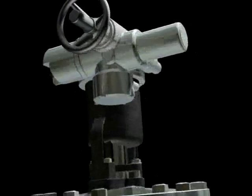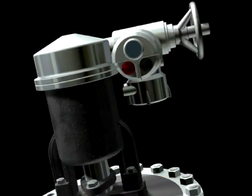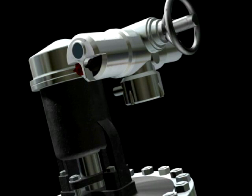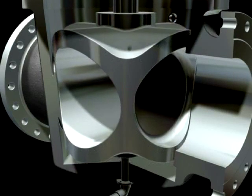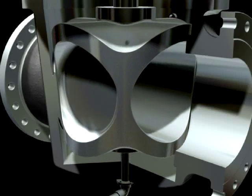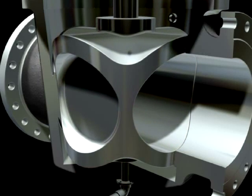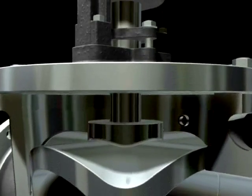The Pacific Wedge Plug features the unique wedge torque system. This single-action lifting plug operator prevents sealing surface wear by eliminating rubbing contact between the plug and seat during plug rotation. The wedge torque system's low torque requirements make it easy to automate using electric motor or pneumatic cylinder actuators. When the operator hand wheel is turned, the fast-acting wedge torque operator first lifts the plug straight up from the seat. As operator rotation continues, the plug rotates to the desired on or off position. Once in position, continued operator rotation creates positive mechanical thrust driving the plug straight down into the valve body seat, ensuring leak-tight sealing with no rubbing. This design automatically compensates for wear and process temperature changes.